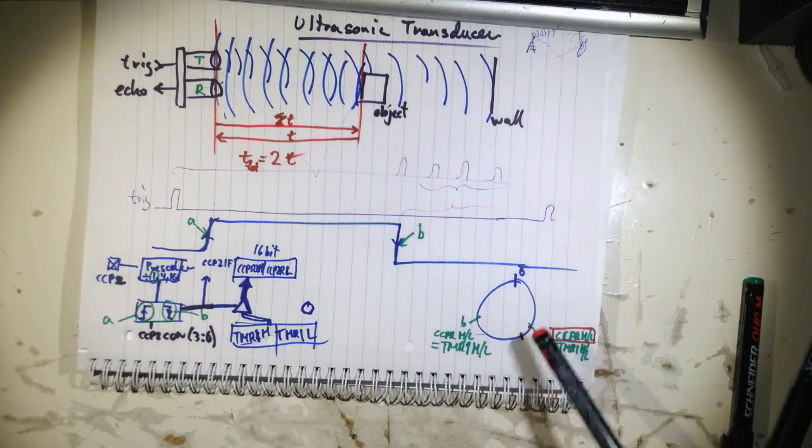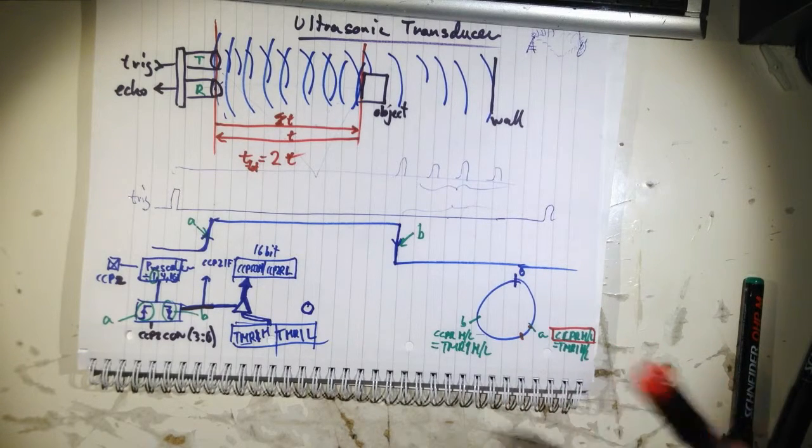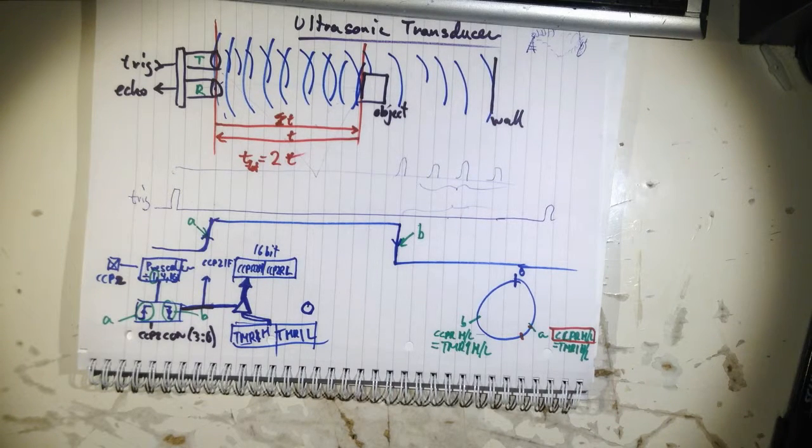But the thing is, it is capture, so if your timing is supposed to be very precise, you have to have a high resolution capture. Let's say you want to synchronize to a GPS satellite, because they have an atomic clock, which is very precise. If you want to synchronize to that, you would want to capture it within a very small time frame, with no jitter. So yeah, there you go.